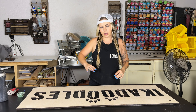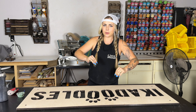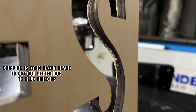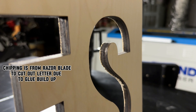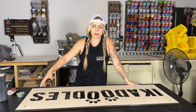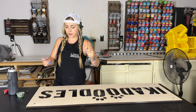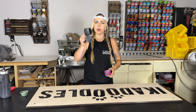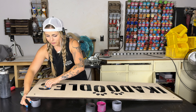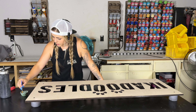I flipped the sign over and it looks amazing. I did a light sanding with 400-grit sandpaper over the top to clean up a few char marks. Diving in closer, I noticed some chipping in some of the letters — especially this 'S' — and I think that's from glue buildup in the plywood, not from the power loss on the far side. Also, these little tiny brushes from Amazon in a huge cheap pack — stop throwing them away! I use them all the time and I have a whole bucket full. Let's dip this in here.